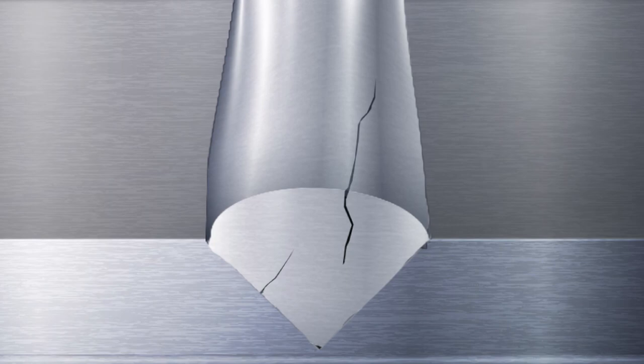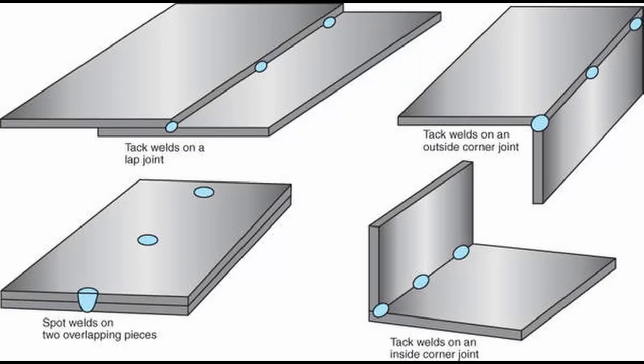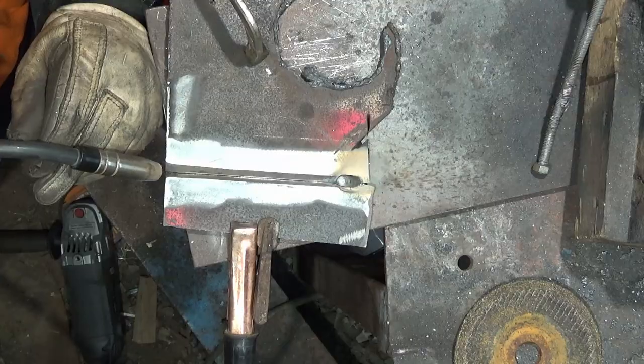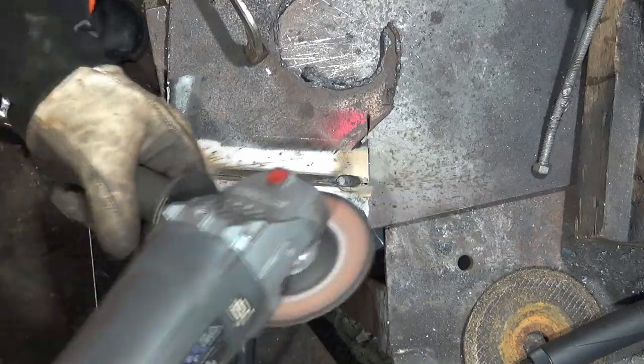The first thing I'm going to do is tack welding — small welds used to hold your pieces in the exact position they need to be welded in. Once it's tack welded, measure it all up, make sure it's absolutely perfect, because if it's not, cut it off now, grind it all back down and start again. I usually put a tack weld around every 200mm, but it really depends on the object I'm welding.